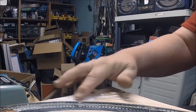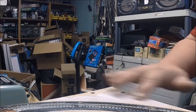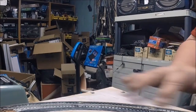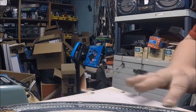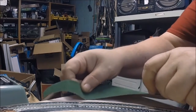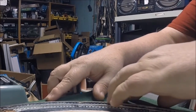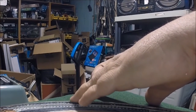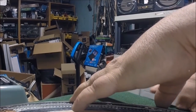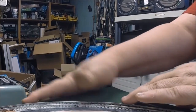Obviously you want this to be good and clean. On the bigger areas I use a paintbrush or a sponge brush and thin it down a little bit. But for these small corners and smaller sections, I find just taking my finger and laying the glue out works well. You just want it to be nice and smooth — equal all across and well covered. Then you just take the piece you cut out earlier for the pattern and layer it on there. You'll have a little bit of adjusting time if you need it. It sticks down pretty quick — once it's glued down, it is glued down. I had a piece I wanted to move and found out after about 15 minutes there was no moving it. It was done.